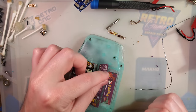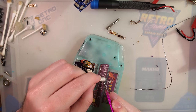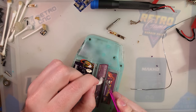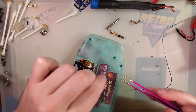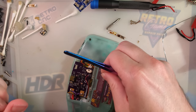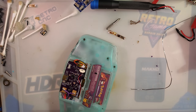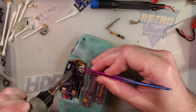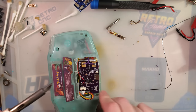The problem in this specific case is that the silkscreen marking is backwards. So I had the chip in the correct orientation according to the silkscreen. Unfortunately, there are two different parts that can be spec'd for U1, and I have the one that the silkscreen marking is backwards on. I'm just trying to clean it up. It's covered in flux. And now it's covered in Q-tip. All right. The only reason I wanted to clean it was so I could see that marking. All right, here we go. Yeah, what are the chances, right? See if that was enough to fix it.